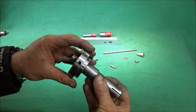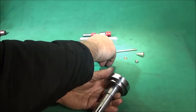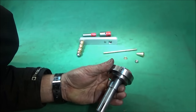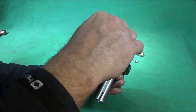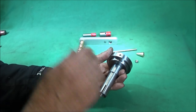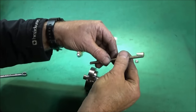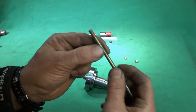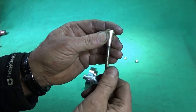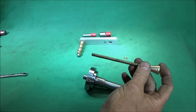So that one pushes down over there like that. A pin drops down into the indent, and then a 6mm grub screw screws down onto the pin, pushing it into the indent. And remember, it will be with Loctite when it's finally assembled. Next, you get the other 6mm studding and screw the brass cone on the end. Like I say, when this one's assembled as well, at the end it will be loctited onto the threading.